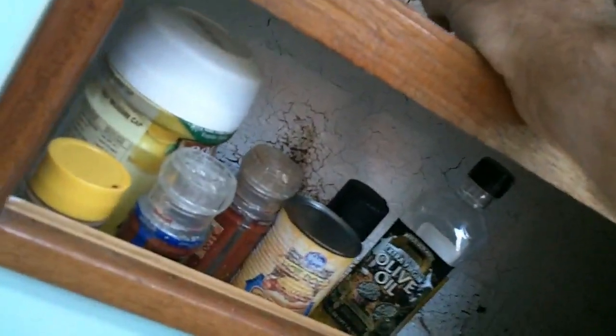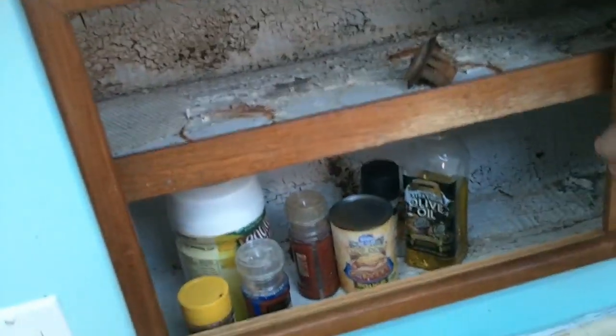There are some cleaners down here and more access. There's another table that flips up, and you've got storage back here. You can see the peeling paint — this is where all those bolts are for that track, so those need to come off and be re-bedded. The first thing I noticed when I came inside was this — one of the knees for the chain plates. It's just a little bit damaged right there. The chain plates are all exposed — this one here was good, and there's one inside the hanging locker that's in good shape.